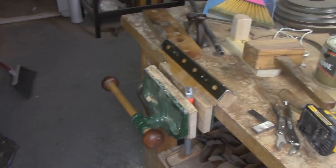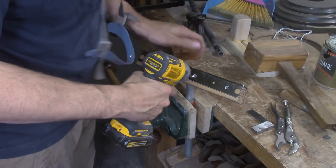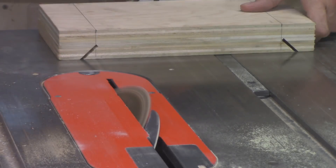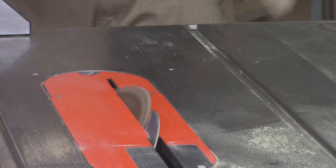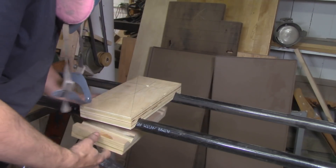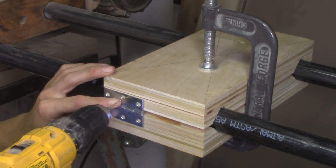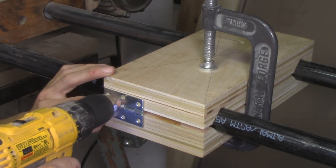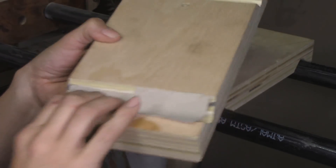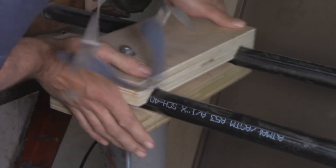To protect the tool rest from damage, I grab a scrap of angle iron and screw that to the top, and now I have pretty much the whole tool rest assembly — and it looks like it's going to work great. To finish the platform for the ways, I grab the plywood I glued up before, take it to the table saw, and cut 45-degree channels that matched up with the pipes, letting those pieces sit really nicely on the round ways. I want them to be able to clamp tight but also loosen so I can move it back and forth, so I put hinges on one side. I got part way through installing them when I figured out that since I had the pieces clamped down, the hinges were going to be set too tight. So I stuffed a couple pieces of thin cardboard in there to give me a little clearance, finished installing the hinges, and pulled the cardboard out — giving me just the right fit where it could slide but also pull down tight when needed.